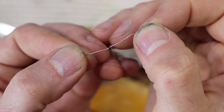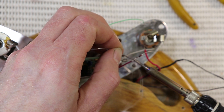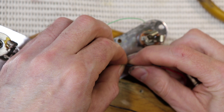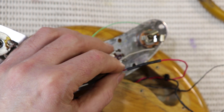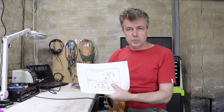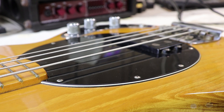The other thing you can do - and I've done it in this bass and in the '77, and it's also been done in all of the modern Stingrays I've seen - is add a diode. I just used a 1N4148 silicon diode wired in line with the positive side of the battery. There is a slight voltage drop associated with that, but in the context of this circuit, the signal from the pickup, and how much boost this circuit makes, it makes no practical difference to the sound, but it will save it from damage in case of that little mishap with the battery. There was one other thing I did: I went over this schematic - which you can find online - and compared it in more detail to the exact circuit in this bass. There was one major difference: the output cap should be 10 microfarad, not 1 microfarad. There were also two or three very minor differences that probably don't make much difference, but for what it's worth I'll put a copy up on my website.